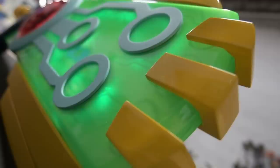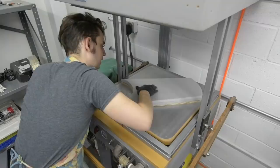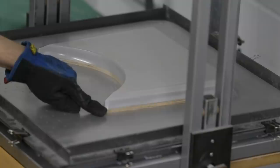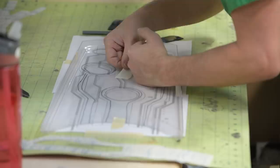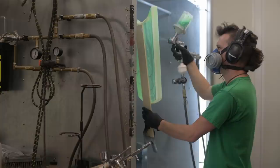It's going to make everything glow a lot nicer and be a lot brighter once the whole sword is assembled. The most iconic, striking, visually arresting piece of the Transistor is the blade — this giant glowing green segment of the sword. In order to create this, we took clear PETG plastic and vacuum formed four individual pieces. These were then trimmed out on our drill press. Before painting, we added a set of transparent, reflective vinyl decals to the inside of each of the blade segments that emulates that technological process look that permeates the entire game Transistor.